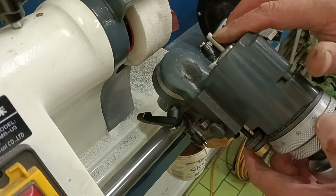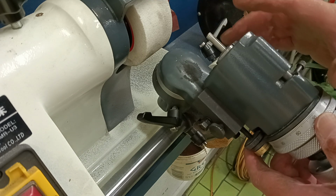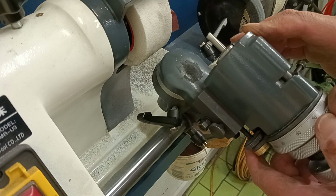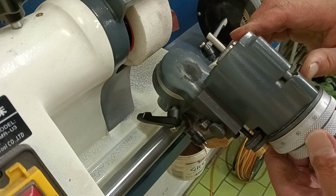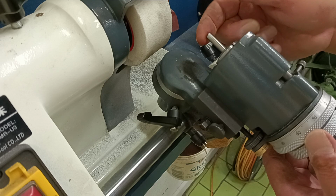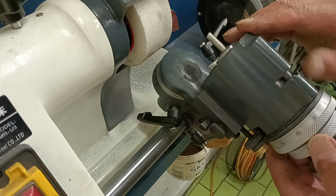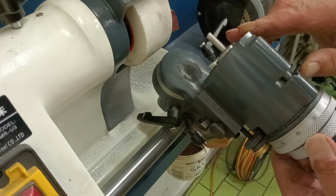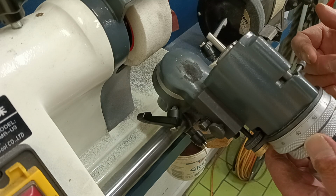This is a very common cutter you use for engraving, and you taper them, and there's a bunch of ways of doing it, but effectively it's the same thing here. Now, normally I would go around maybe 20 degrees for a relief angle and put the radial relief on it. This time we're going to go to basically 60 degrees, which is quite a substantial angle in the back of this, because that's the facet we're talking about here.